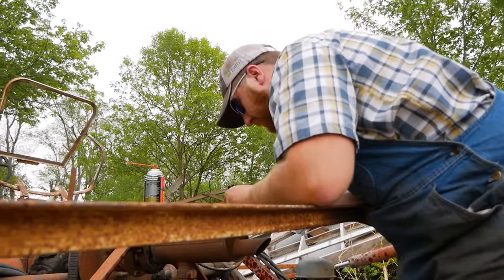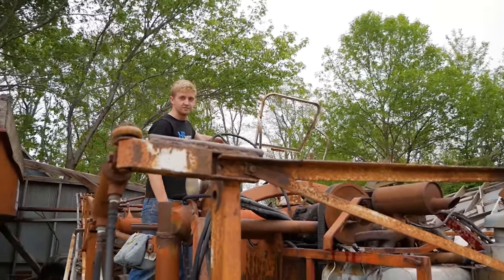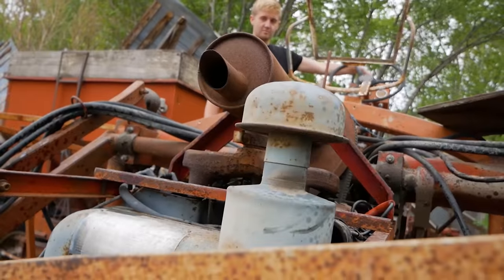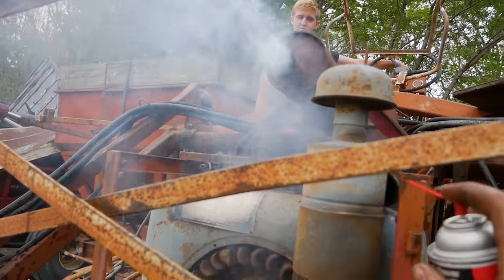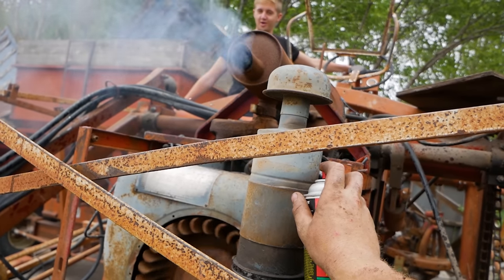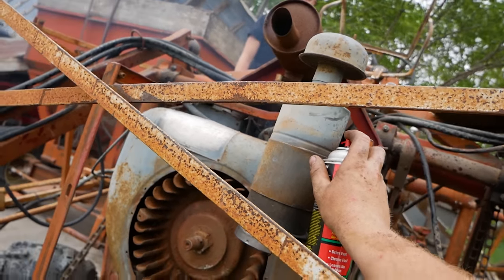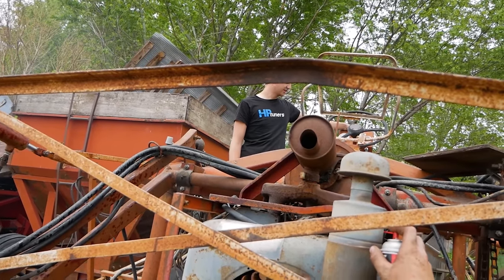Let's open these gaps up a little bit and try again. Plugs are cleaned off. A little more brake clean down the cylinders. Spun it over for a good while. Let's try it again. She's got throttle. I feel like I'm flooding it, but it wants a lot of brake clean to do anything. Hit it.